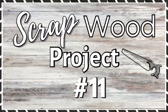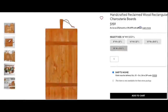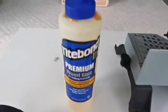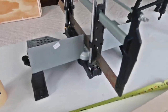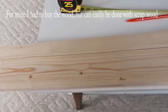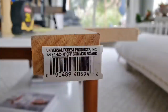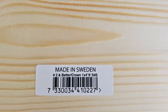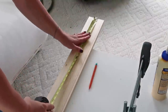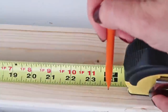Project number eleven. This is my inspiration piece from Pottery Barn — it was $159. I just loved how huge it was and that it was a two-toned cutting board. For mine, you're going to need some wood glue, something to cut the wood — I'm using my hand miter saw — and a measuring tape. You will need a couple pieces of wood. This one is three quarters by one and a half by eight, and these were very cheap at Home Depot. The next size is a one by four by eight — also very affordable. They aren't oak or maple — this is kind of my tester piece, so I went with the cheaper wood. They were just a few dollars compared to the $159 cutting board. For the first pieces, you're going to use the thicker wood and I am cutting mine at 24 inches — that's going to be the base length of your cutting board, not including the handle.